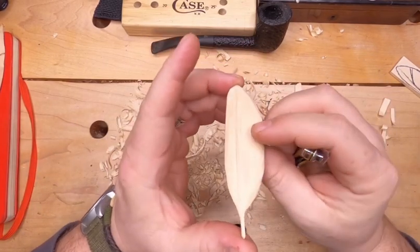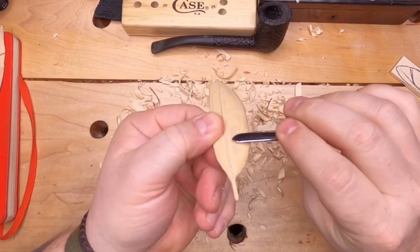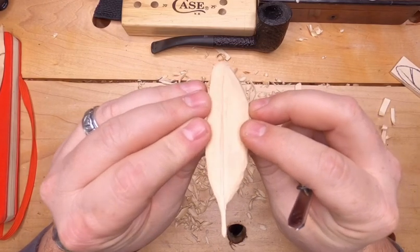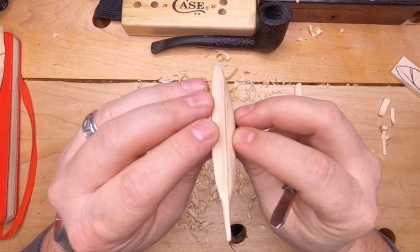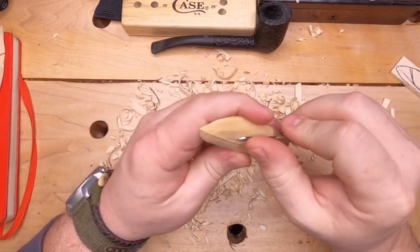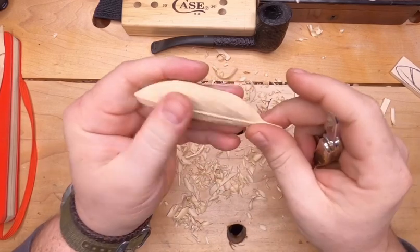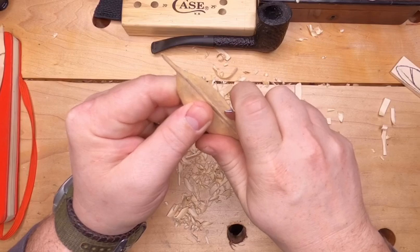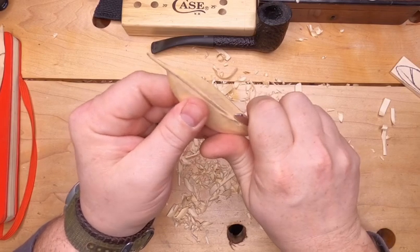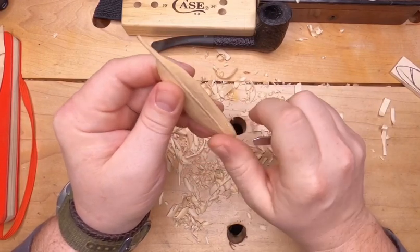If we look a little closer here — when we started, we scored down either side of the shaft of the feather, and by thinning out the material to the left and right of it, now that portion stands out just slightly. See that slight shadow you get there — it's not too prominent. Then when we came in and cleaned it up, that rounded off the shaft for the most part, and we don't have a whole lot of tear here, which is also good. Tear happens when you're first starting and even after you've been carving, but you learn how to clean it up and it comes with practice. So that's how you fix a tear — practice, and knowing how the grain is flowing with each piece.